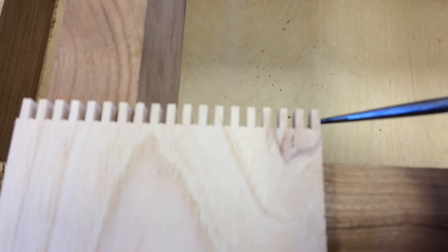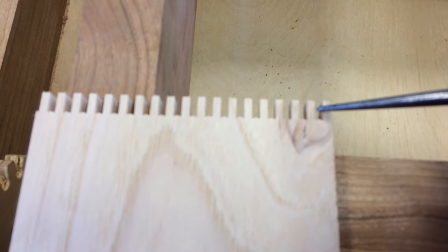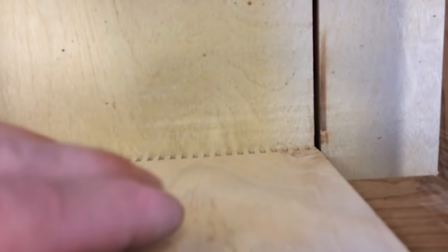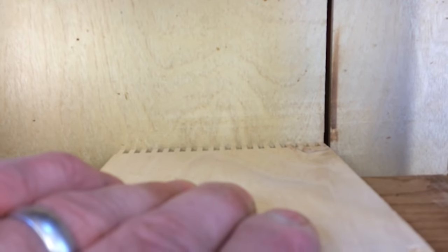It's a quarter inch from the edge of the board to the edge of that finger. If I put this down here so it's clamped to the carriage and then do one full turn, you can see where I end up. When I cut, I'm going to cut an eighth of an inch away and leave an eighth of an inch finger. Then I back off and move another quarter inch and do it again.